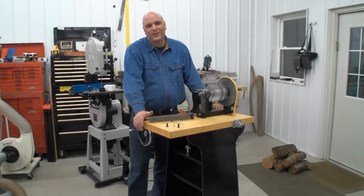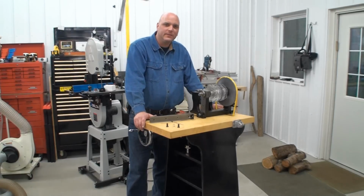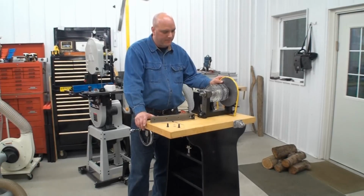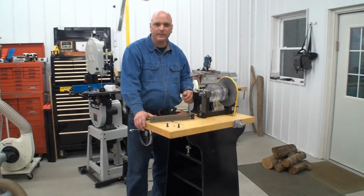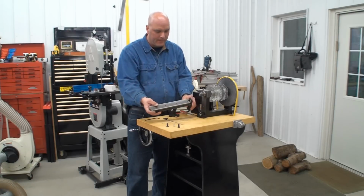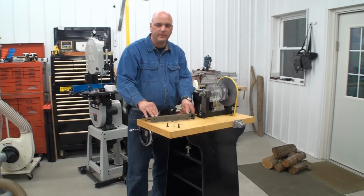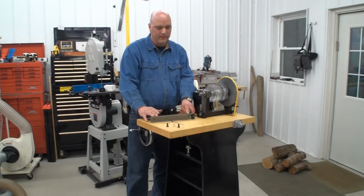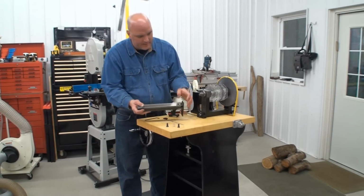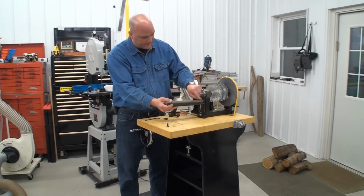I'm here today to show off our new tailstock for the Lindow White Rose engine. The challenge of a tailstock on a Rose engine is that it has to rock along with the headstock. So, unlike a conventional tailstock, it has to attach directly to the headstock. We have made this tailstock to interchange with the pieces of our modular chuck system. It simply mounts by two socket head screws into the headstock.